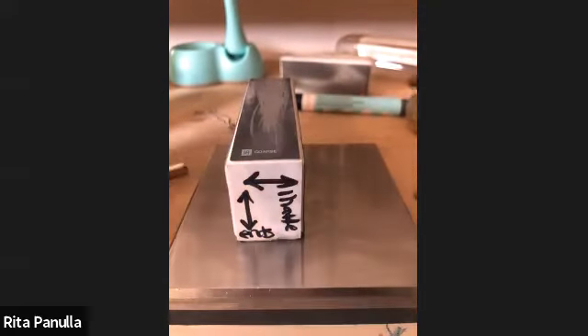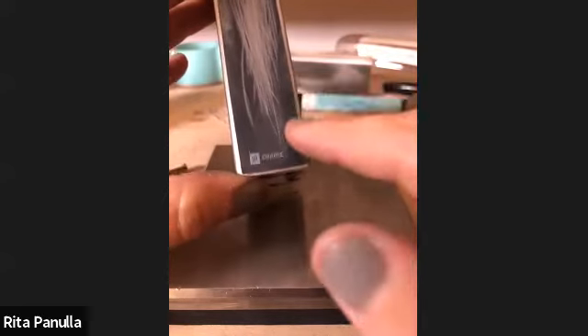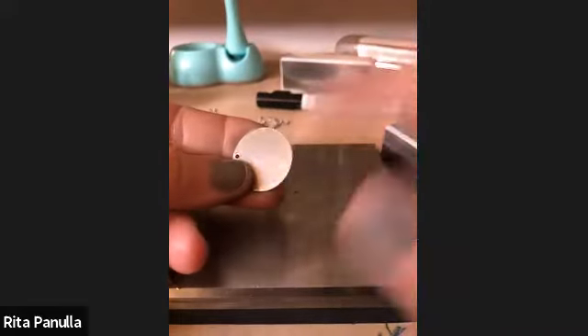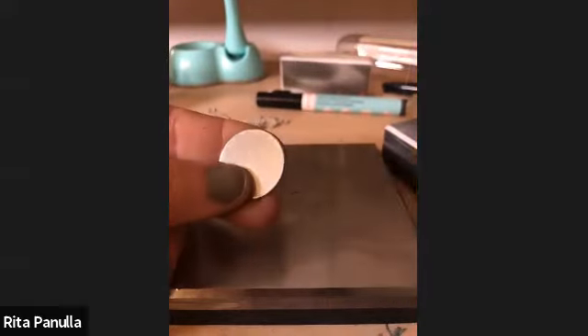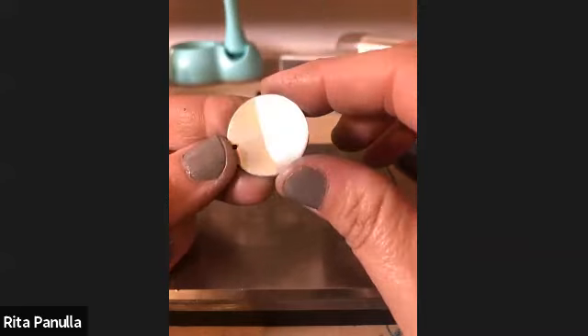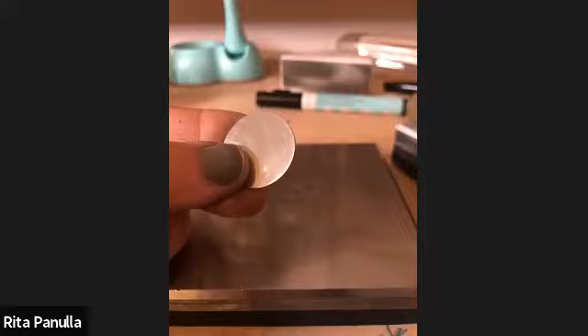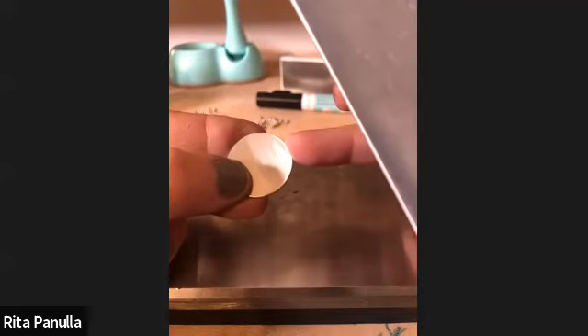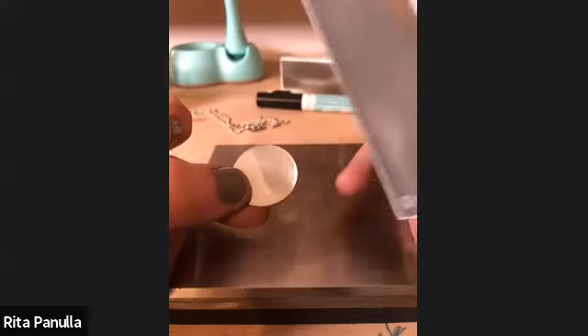The coarse side on both sides of that block is for sanding down your ends. You never really want to use the coarse side unless you want a really rough matte finish. If you want to matte your blanks — these are premium aluminum blanks — you take your medium side and run it up and down your entire blank. You can see how it's shiny on one side and matte on the other. If you want a matte finish, matte your blank before you stamp onto it.